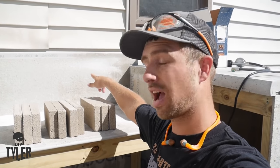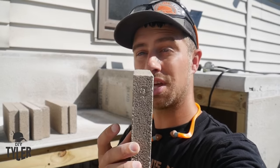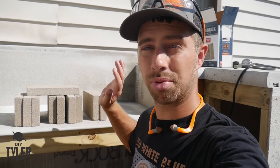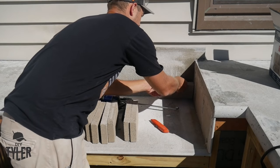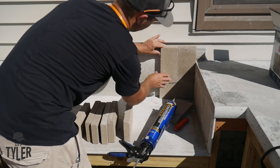The griddle is going right here. We got concrete board, but we are right up against the house, so I want a little bit more protection to help keep the heat out. These are fire bricks — they are meant to go in a wood stove and can handle up to 2,000 degrees. I think this will help prevent any heat from getting into the house. You would think we would use mortar to fasten them, but I'm going to use Titebond construction adhesive on the back. It bonds to cement and stone, so I'll slather some on the bricks, smoosh them into place, and we should be good to go.